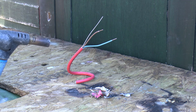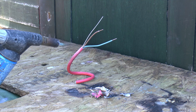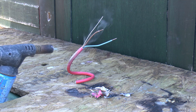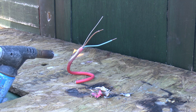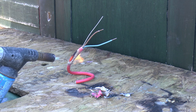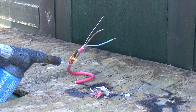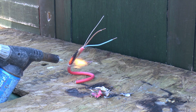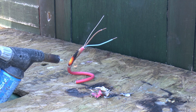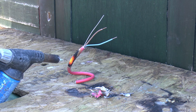Now that annoying piece of junk has flown away, let's try heating the actual cable itself. This is a bit more realistic in that the cable is intact and the flames are being applied to the outside. We can see the outer covering has turned a much lighter colour — almost white — but hasn't melted or disintegrated. It's sort of puffing up and a bit of smoke is coming off, but again fairly small amounts. As the heat increases we can see the inner part is charring and blackening, with parts actually glowing red hot. But crucially when you take the flame away, the glowing red bit just goes back to the black char. It seems to be a fairly robust cable.